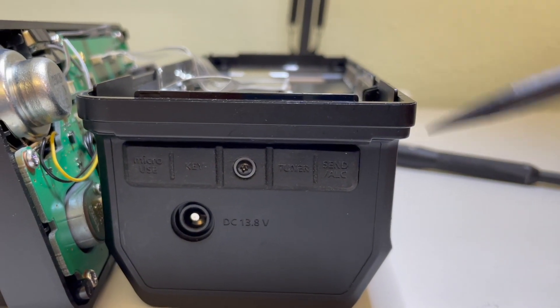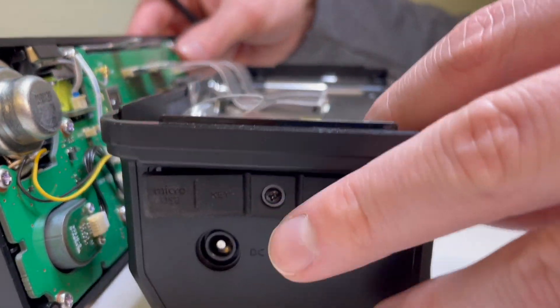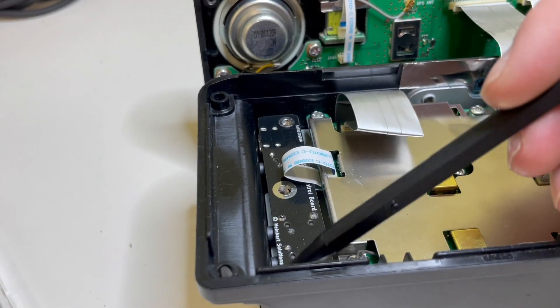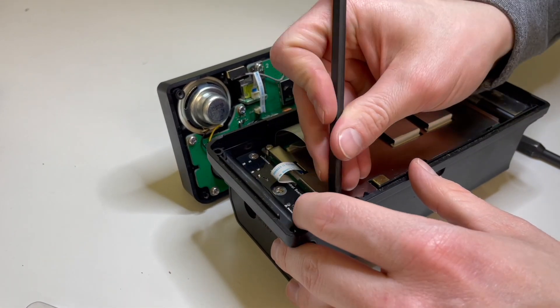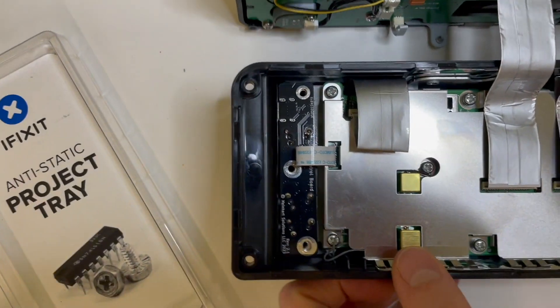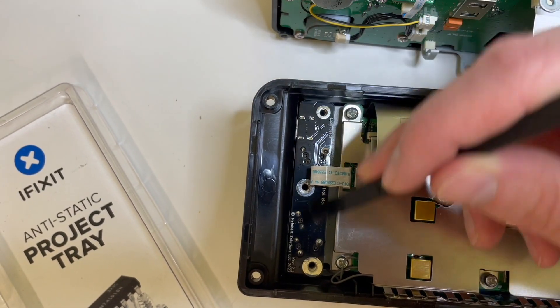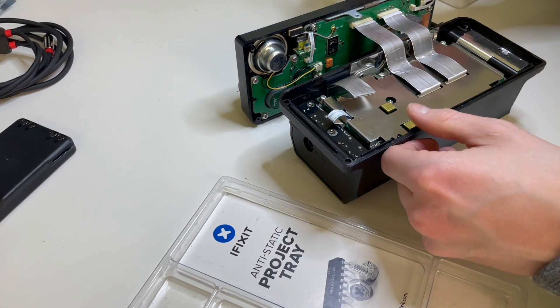Make sure you're lining up the 3.5mm jacks with the holes on the radio. You can tell by where those are going in. Very gently push that in so the screw holes get lined up. Now grab the three screws that hold the board back into place. I usually like to put the middle one in first, leave it a little loose, then put the others in, and tighten them all back down so you know you're getting it back into the right spot.